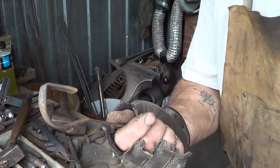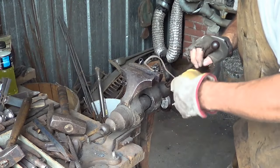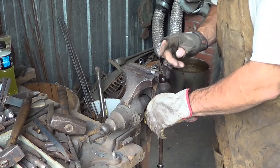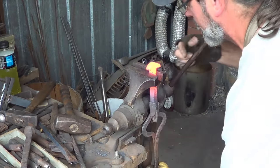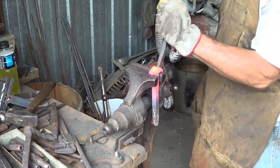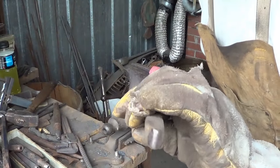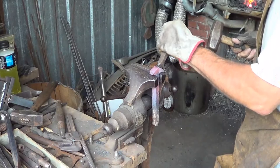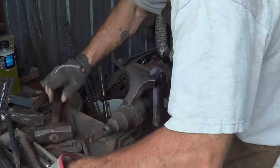For the final cut, I've made up this little sacrificial piece - it's a half-inch, three-quarter mild steel piece, a little bit bent, but it hooks right over the top of the vise so that I can chisel into that without messing up my vise. Get a decent amount of heat on this one, drop it on your sacrificial piece and then finish your cut right down to the steel. I have this railroad spike that I put a pretty good rounded nose on, kind of like a fuller, and I go ahead and spread those horns a little bit to give me some more working space. Up at the top I put a couple of hits just to put a little bit of detail in of those horns rolling into the forehead.